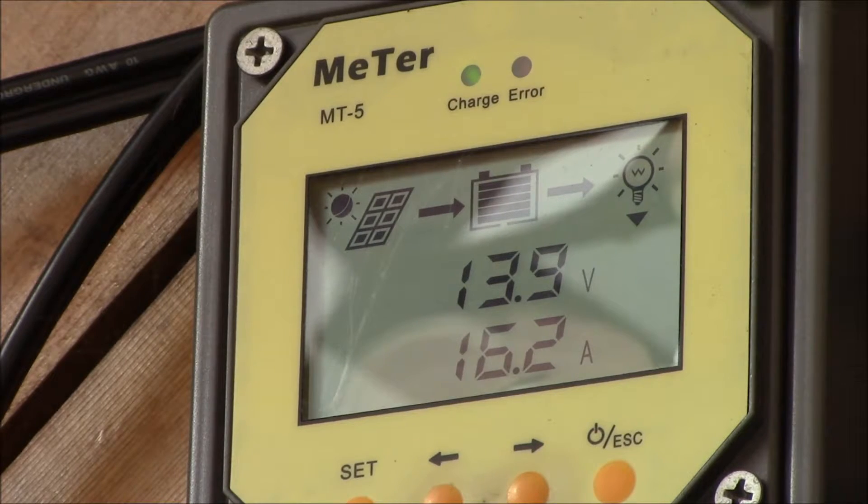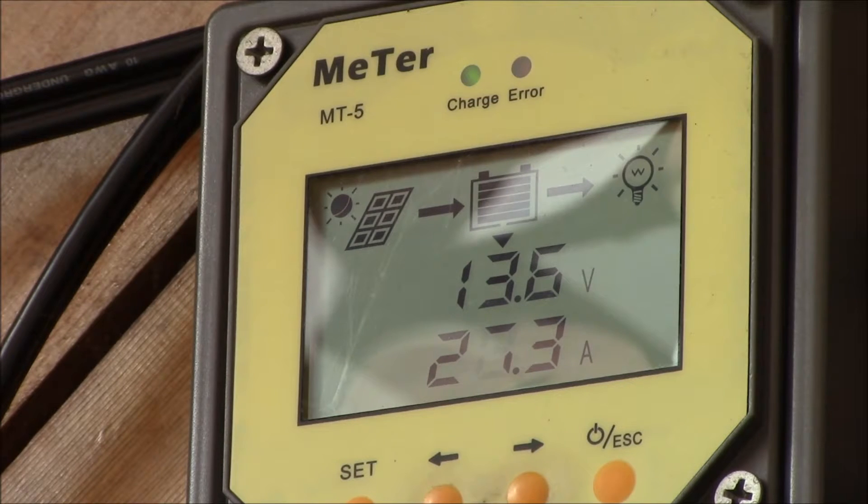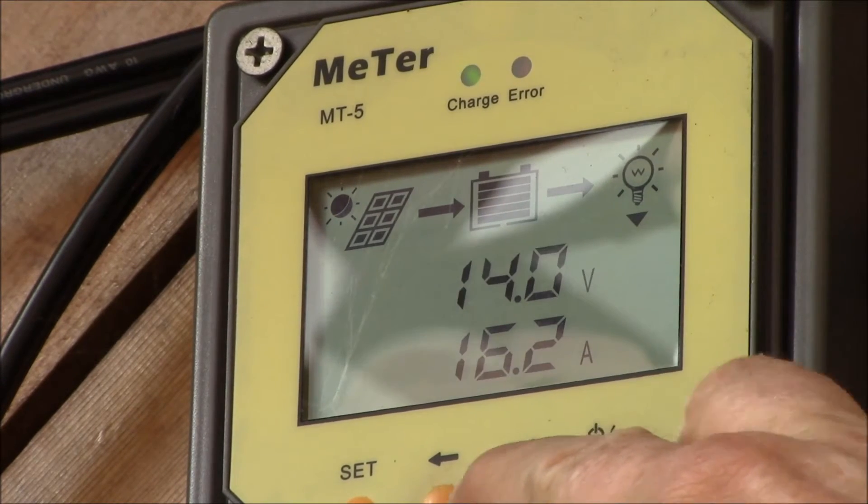Looks like it's working pretty good today — 16 amps on the DC, 24 amps of charging. Looks like the clouds rolled back in. What happens is the charge controller supplies the DC load no matter what, and then any excess power goes into charging the batteries. You can see now it's actually jumped up to 27 amps. Since it was discharging for a while, it's now charging the batteries with a little extra current — I'm getting about 1.6 amps going into the batteries, 25 amps into the inverter, and 16 amps out to the loads.